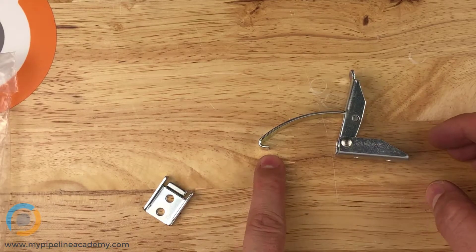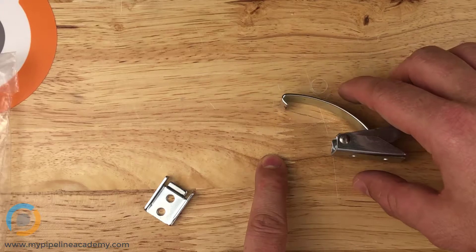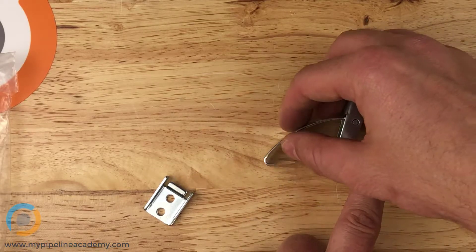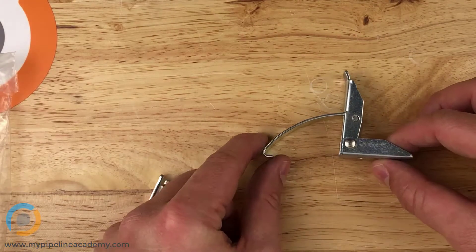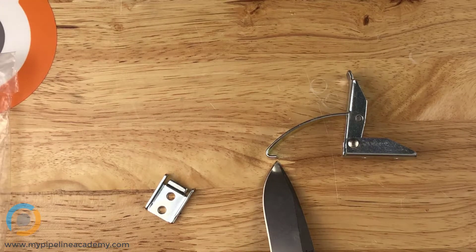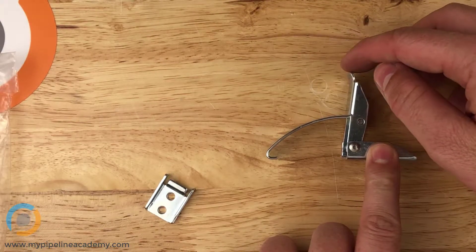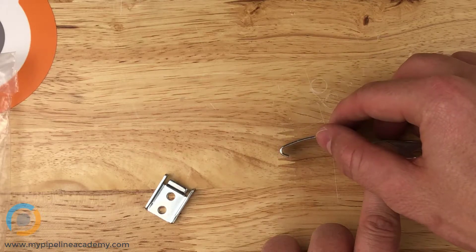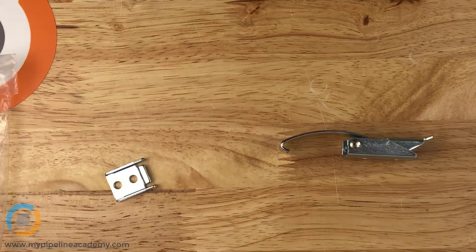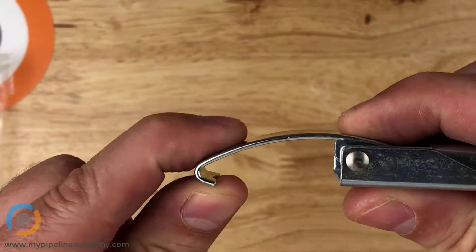So if you can see where my finger is right now, that's where the end of this latch is. When I close it, it doesn't move very much. Let's see if we can do a better job here. The end of that latch is right here at this interface, and as I pull this back, you can see it has moved maybe a quarter of an inch or three-sixteenths — that's how a draw latch works. This curved member right here will straighten out a little bit.